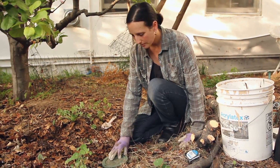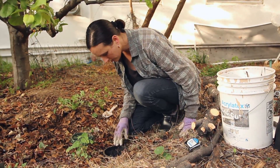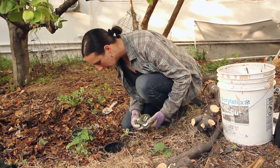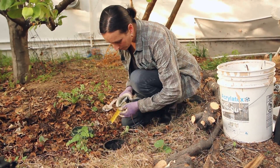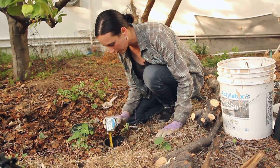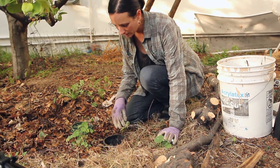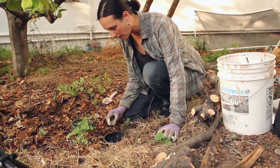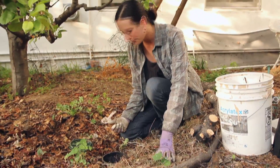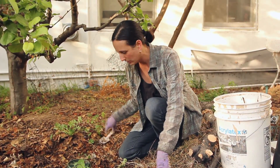So I'm going to check my first outlet. Looking inside, I see the greywater outlet. It's unobstructed, but it looks pretty close to the level down there. There's only about an inch of space before it's hitting the soil, and I'm seeing soil. So there's two things I need to do. I need to remove that soil, which is actually composted woodchips, plus the composted food that went through the system.